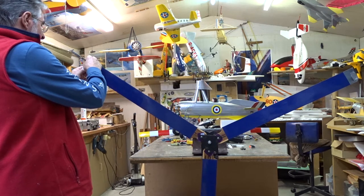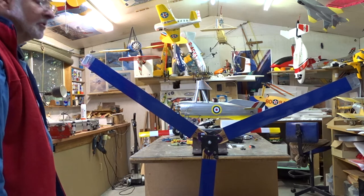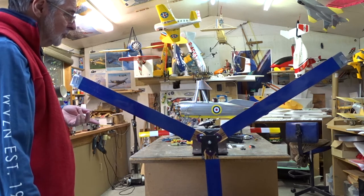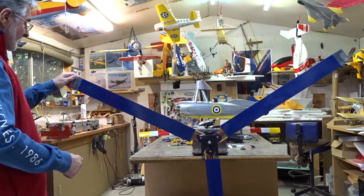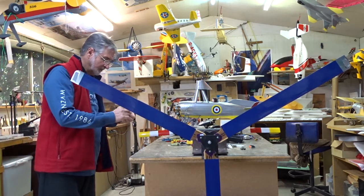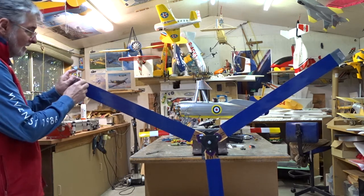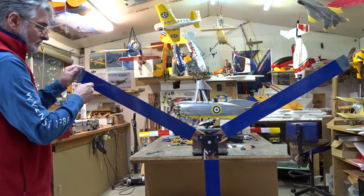So, a strip of tape. I never put it fully in place first — just partly in place, because I might have made it too big. This is nearly as interesting as watching paint dry, but I like watching paint dry. That hasn't particularly unbalanced. Number two — they're pretty similar there, that's good. So what that means is I should have to add weight to two and one equally to bring it up to weight. I have a strip of tape here that I will cut in half and put on there.